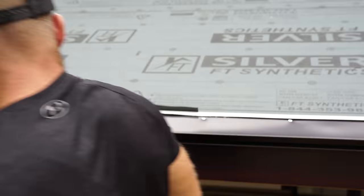All right. So now that we have our standing seam here on the porch, this detail here, we've gotta have a connection detail flashed underneath our sidewall. So what we have is an open hemmed transition piece. And this open hem right here is gonna lock onto a piece of Z flash, but first we have to figure out exactly where that's gonna be. So we wanna make sure it's running at the right plane. And then we're just gonna go ahead and mark right on the face where the face of this trim hits our rib.